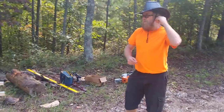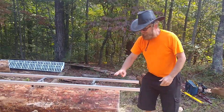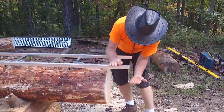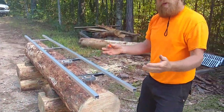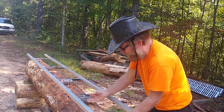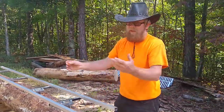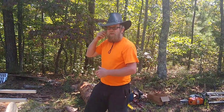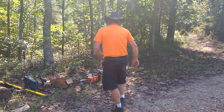I've already warmed up my chainsaw, we'll run the first slice now. Also keep in mind that on this particular setup, based on the lag bolts and screws I have, the chainsaw mill is set up so the chain cuts at a fixed five and three-eighths inches — that's what my first cut always is on here. No matter how high or low you have the lag bolt adjusted, it's never going to be lower than five and three-eighths on my particular setup.